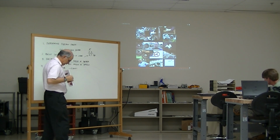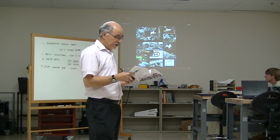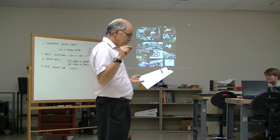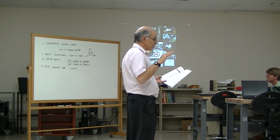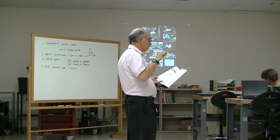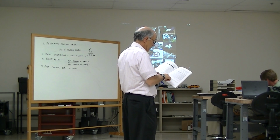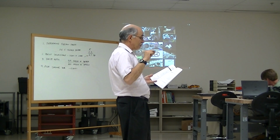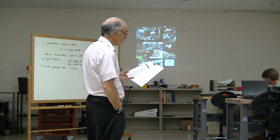And the chart's going to look like this chart right here. I think there might be one of those in that book too. When you first look at this chart, it's a little bit confusing, so you've got to read your directions carefully. It says first you determine the appropriate size of the smaller sheave, as shown in figure 33, and figure 33 is here, so you choose that sheave diameter. Then the larger sheave is found by using the drive ratio. From this table, you must find the sheave that meets all the following requirements.